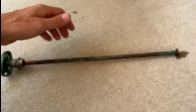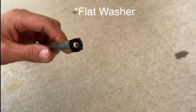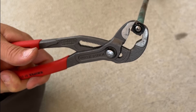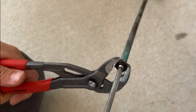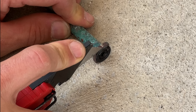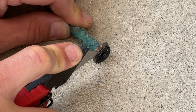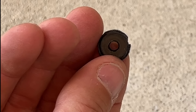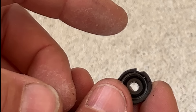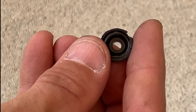The serviceable flat o-ring we're looking at is right on the end of your stem. Inspect it for damage — I can see some cracks and chips — and that is the source of your dripping or leak. Hold the stem with your channel locks or slip joint pliers, and with a Phillips head screwdriver, undo that screw to remove the flat washer. I use a utility knife to pop it off the stem without damaging it so I can keep the original diameter as a reference. Although these flat washers start off completely flat, over time being turned on or off they get grooves and chips, which is the source of your leak. The more you tighten them down — especially if they have a crack — the leak sometimes gets worse the more you turn that handle.